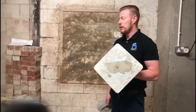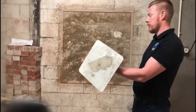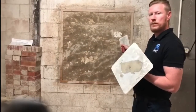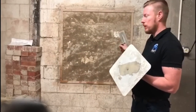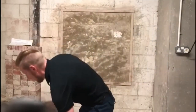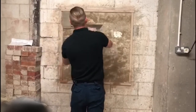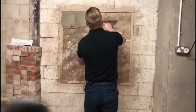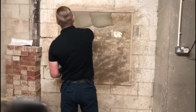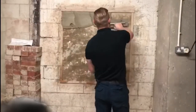Plastering and dry lining, and today we're going to do a wee bit of internal plastering. So we have set our board up, prepared the wall with water to prevent any suction, and now we're going to coat out the wall, straighten it, and devil float it. Okay, so we're just going to coat it on in unison here, all the way along.